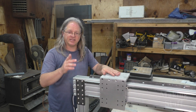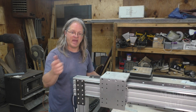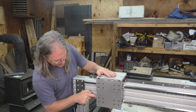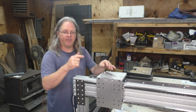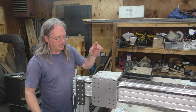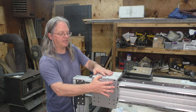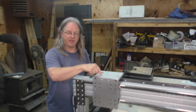I know some of you are going to say I should have machined the back of this plate, but I don't have the capability to do that in my shop. So I came up with another fix — my playing card shim trick. I just put a little piece of playing card behind the outside parts of the linear rails and tightened the screws down, and that did the trick. I still get a smooth scroll on the linear rails without any additional machining. Maybe in the future I can redo this plate, but right now this channel is all about using what you've got.